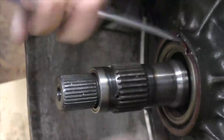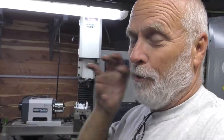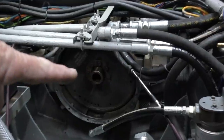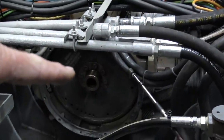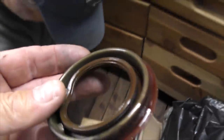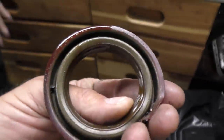There's a pump back in here driven by the torque converter eliminator, and there's a seal in here. We're going to go ahead and change this seal out because it's a convenient time to do so, and we could have torn it up by the way we took this out — we pulled the whole transmission off before unbolting the torque converter. The seal comes out and it still has a spring in it, and it's undamaged. So maybe taking it off that way isn't bad.